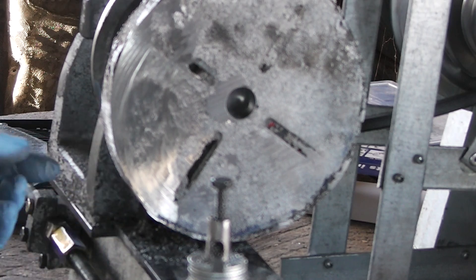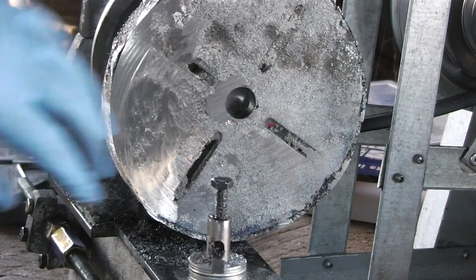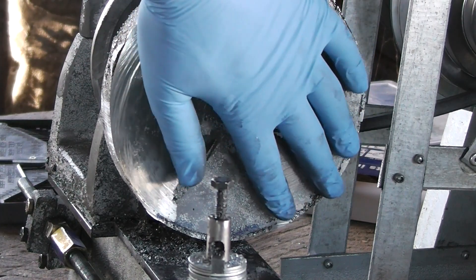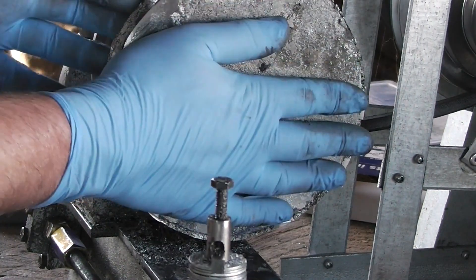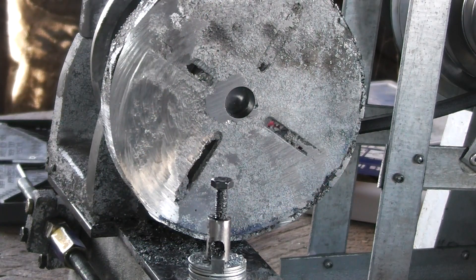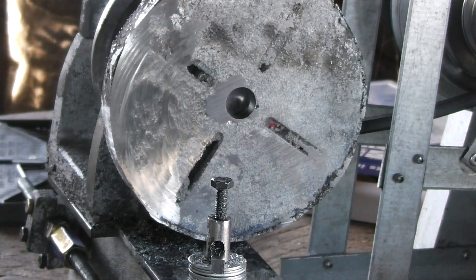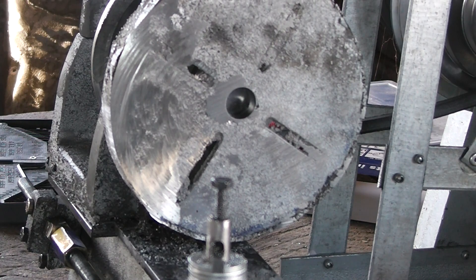That's the road plan then — next weekend I'll cast another faceplate. Rather than cast on the mandrel, I think I'll just cast this solid across here, make it flat on the belt sander to get myself started, and then once I have got it flat I'll lay the surface down flat on the table of the drill press and drill the hole perpendicular. Because even after all that, I still had to drill it out anyway — I didn't get the right bore.